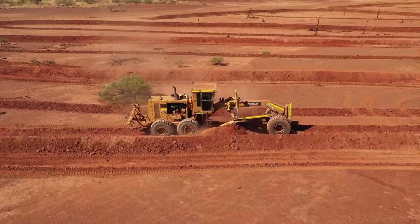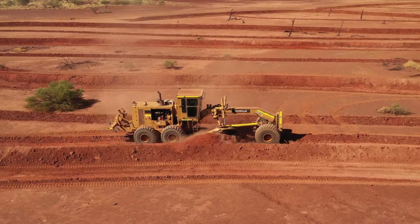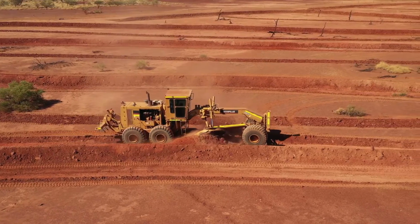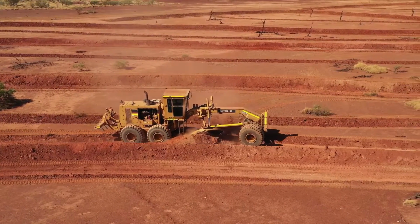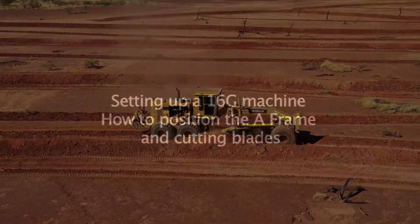In our construction phase, we've used a lot of different types of machinery. Everybody's got a Cat 12. We've tried those over and over, and we've found we just can't get the required width and height in the banks for what is needed. Other fellows have tried disc machines, we've tried opposing blades, every type of thing, but it's come back to the big 16 graders, the big horsepower graders. They are the most economical, and that's what you should be chasing to do your construction.